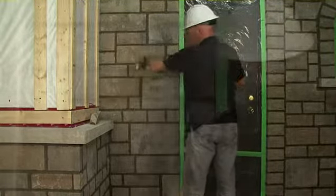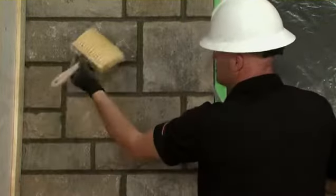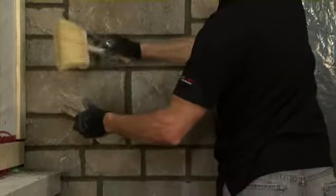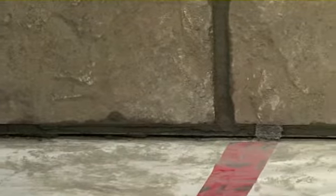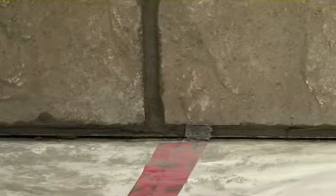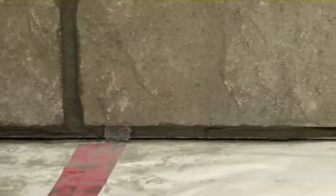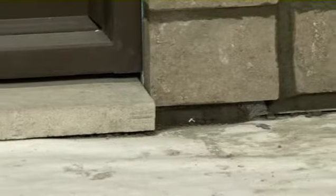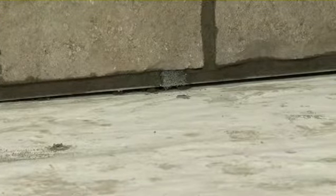Let it dry for a minimum of one hour, then carefully brush it all with a whitewash brush, which will remove any surplus and dust. Never let your brush get dirty since that will get dirt on your units. The weepers, which are positioned at the base of the wall between the first stones and the starter strip, must not be dirty with mortar. They will be spaced at 24 inches center to center and serve to evacuate water or condensation to the outside while preventing insects from penetrating. The weepers are very important to ensure the effectiveness of the SureTouch system and should not be neglected.